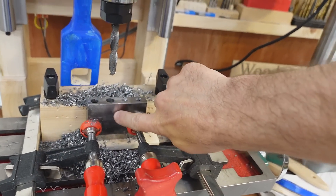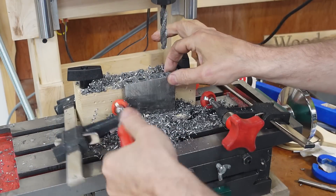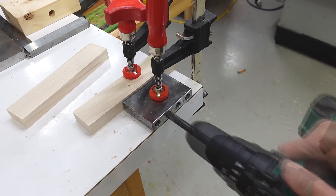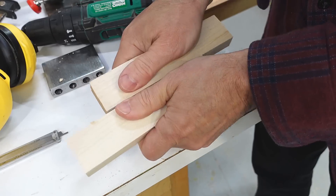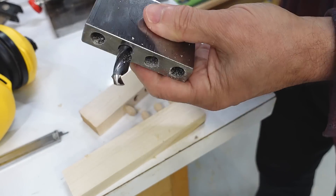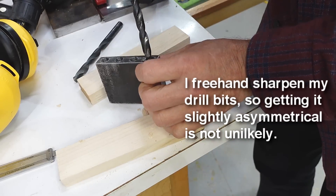After finishing the second hole the workpiece got too hot to touch, so I've been cooling it with a fan. The hole spacing is not as consistent as I would like — especially this last hole. But the misalignment still seems within reason; I can close the joint just fine because the dowels are in rather loose. Some of that misalignment may be because the holes ended up bigger than the drill. I suspect the drill point is slightly off-center, causing it to wobble and cut the hole a bit too large.